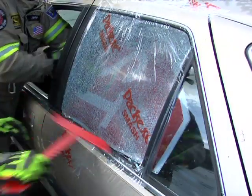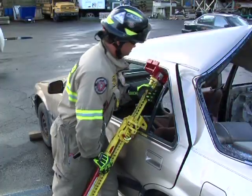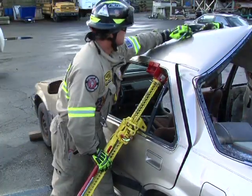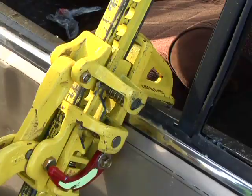Next, remove all the glass from the vehicle and place the first responder jack with its base capturing the roof rail in the rear 1/3 of the door to be opened. At this point, consider placing foam balls, racquet balls, wedges, or straps to force the door handles of the affected door in the open position.